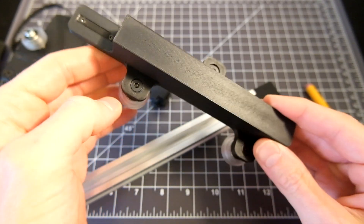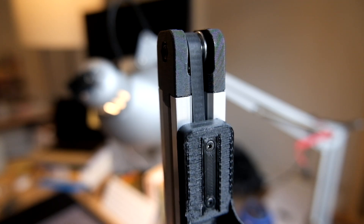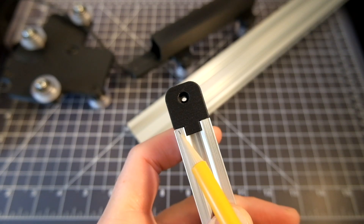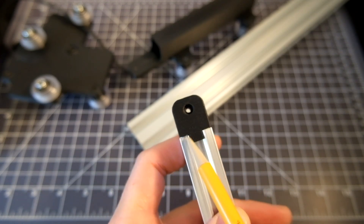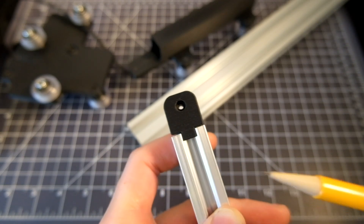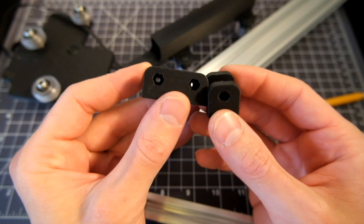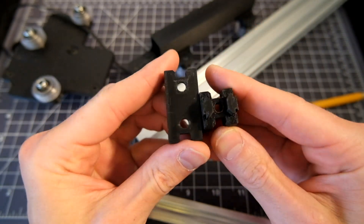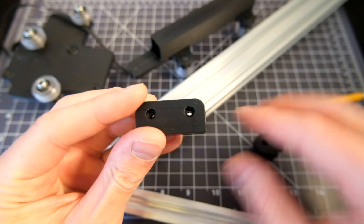Other enhancements come from how I'm going to mount the counterweight to the rail. In the earlier version I needed a piece I called the pulley assembly where the pulley mounts and transfers the belt from one side to the other. When mounting this to the 20 by 20 rail I needed to use these little tabs to keep it from spinning around. Overall it looks okay, but on this layer where it meets the aluminum rail I'd really like this to be totally flat. Since it's built on top of support material it's never going to be totally flat. What I prefer is for this edge to be printed directly on the build plate, which means it would be completely flat. With the new rail that is possible. So I went ahead and designed an updated version of the pulley assembly for the 2040 rail — it's just a doubled up version minus the tabs. The bottom surface is totally flush, it's a much cleaner print, and when it's mounted it looks a lot cleaner too. These edges meet perfectly.